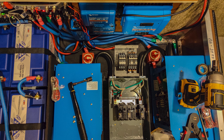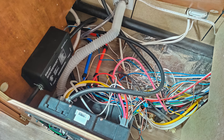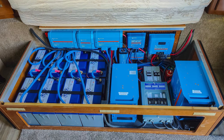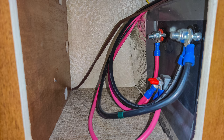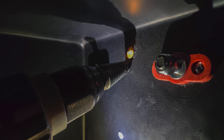Now that I had the batteries and inverters wired up and ready to go, I needed to tie them into the existing electrical panel of the RV. As part of that I wired in a surge suppressor and mounted it underneath the microwave, then realized it would work better where the converter used to be so it'll be accessible in the future. I then expanded out into the EV charging circuit. The battery compartment on the side of the trailer was the best option for that, and I ran the wire up underneath the drawers and into that compartment, drilled a hole through it, and wired up the NEMA 14-50 outlet.